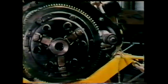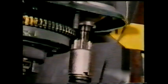Hardness is an essential property in many steel components. For example, the teeth round this starter ring need to be hard. They have to resist wear and indentation. Cutting tools also need to be hard — they must be able to cut other materials.